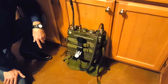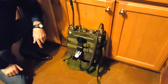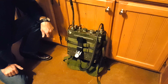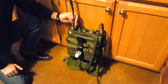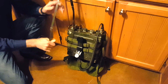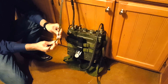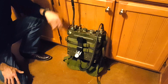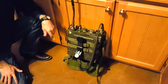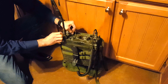You can also get some adapters with a voltage regulator circuit inside that plug into a car cigarette lighter adapter, and you can power it straight off of your car battery. Number six: there are three different antenna options that can be used with the PRC-77. Number one is the three-foot bush whip antenna, basically made out of the same metallic concave-shaped material that tape measures are made of. You can also get a 10-foot whip antenna for stationary operation, or finally you can connect through a BNC coaxial port to a vehicle antenna.